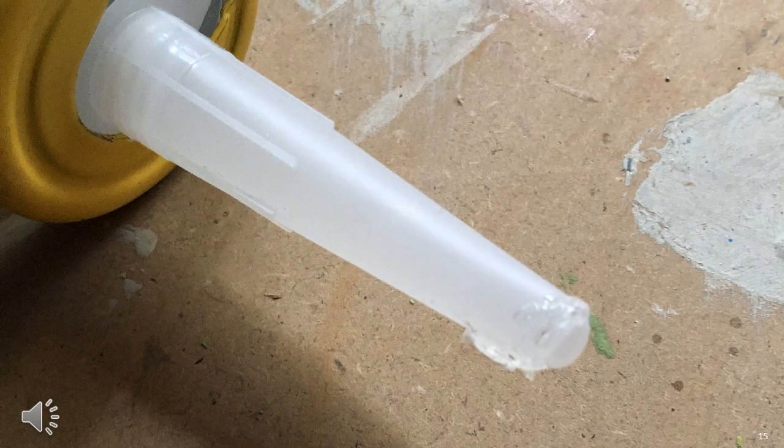Make sure that when you cut the end of the silicone dispenser, you have a large hole. When you squeeze the silicone out, you want to avoid running it up and down the tile, as this results in unusual grooving. The silicone should fill a 1cm wide area, so you only need to run it up and down 3 times to fill in your 3cm wide river.